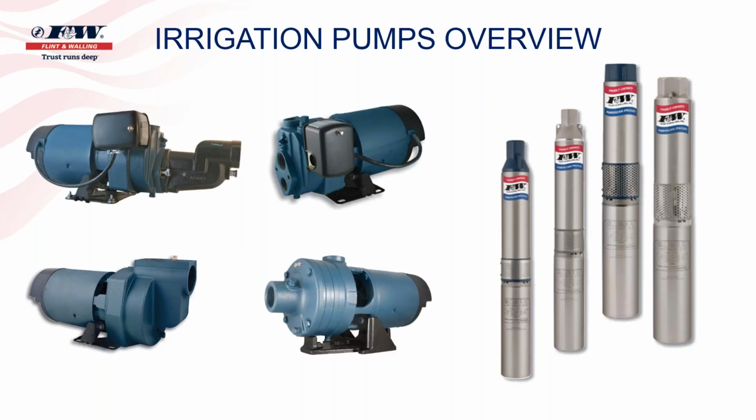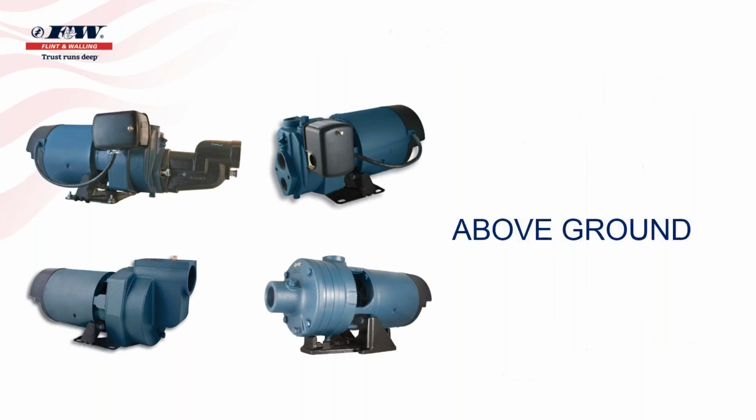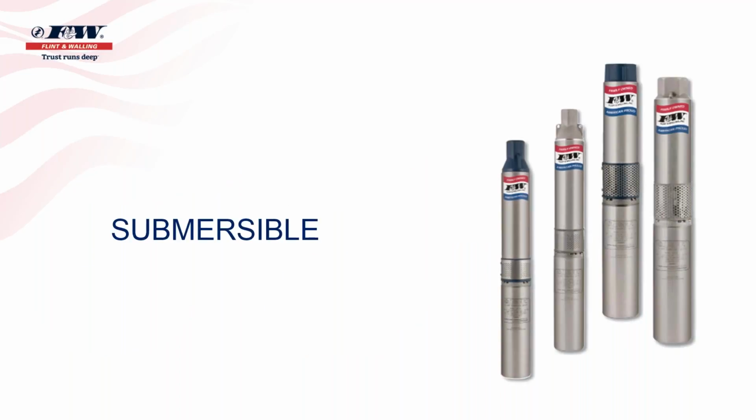When we look at the pumps that are conducively sold into irrigation, we can break these down into two types. I hope that your slides are transitioning fine on your monitors. The pumps on the left-hand side of your screen are what we would refer to as above-ground pumps. These are your jet, centrifugal, and self-priming pumps, and typically these will be installed in crawl spaces or on the edge of a deck. But the bottom line is these pumps are always visible, they're always installed above ground. And then the second category, of course, are the ones on the right-hand side of the screen, which we refer to as submersibles.